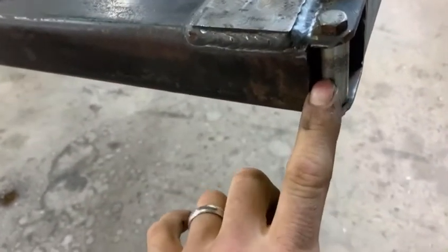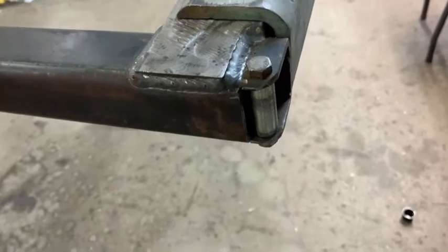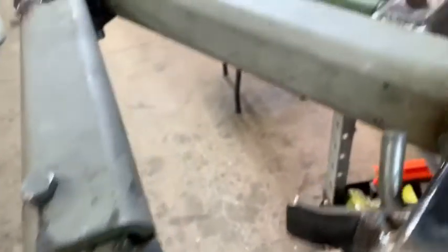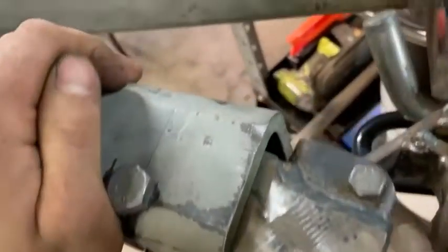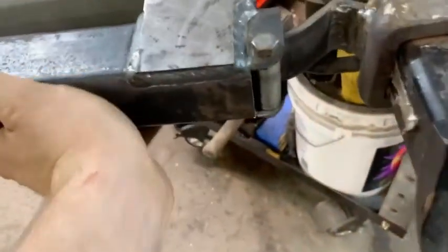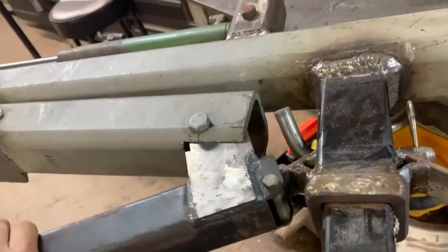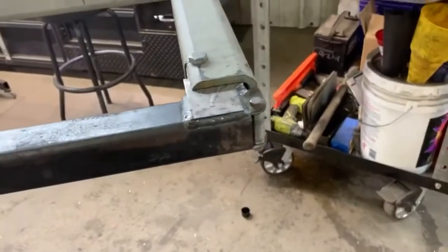How this works: there's a little roller on the back that's going to have a small hole drilled in it for lubrication — can't really put a greaser in that, so I might use an injection needle to put some grease in to keep it lubricated. Not a lot of force on that. How this works is the cylinder pushes it, the roller comes and hits this little piece here, and pushes in. The springs are pretty strong but it folds completely up when the cylinder is maxed out, and then as it goes the other way, the roller rolls around, unfolds, and opens all the way up. Really unique as far as how I built that — I've never seen one quite like it.